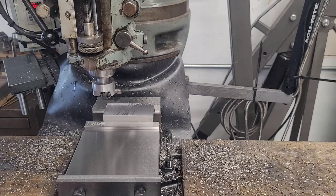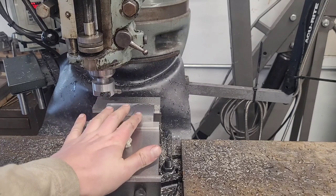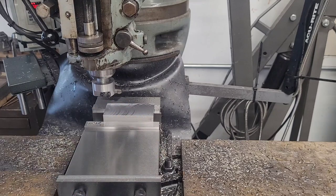Thanks for watching, guys. I hope you found this interesting. If anyone is interested we can talk about making these — I can show you some really simple setups. Counting lathe time, I think I made this tool in about an hour and fifteen minutes including grinding, because really all I did was take a scrap piece of steel, turn a 7/8-inch shank on it, put two cuts on it and two holes in it.